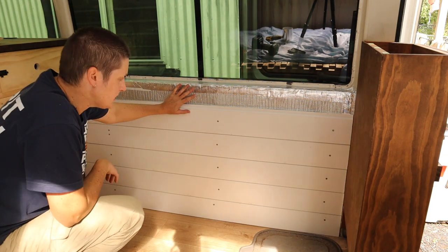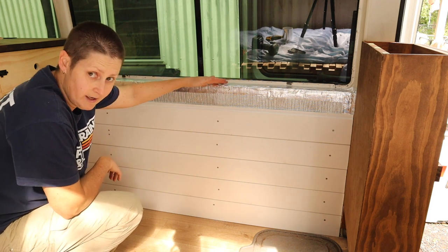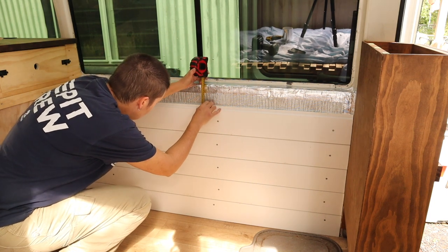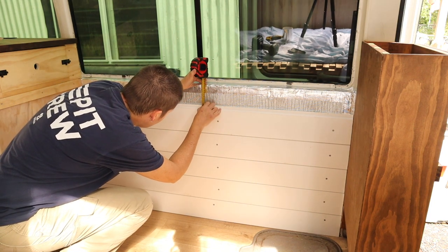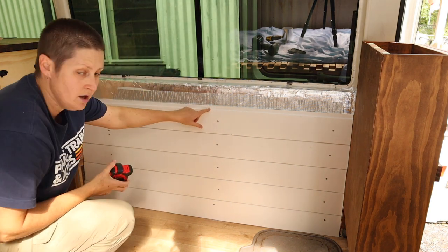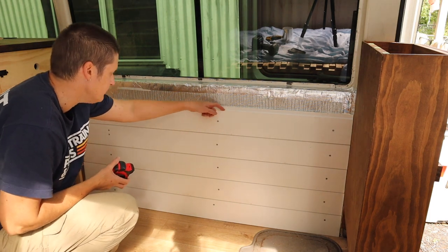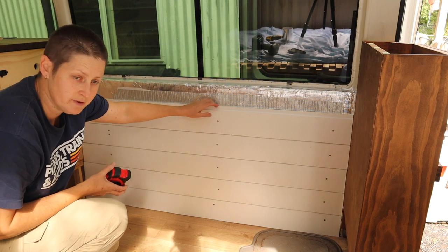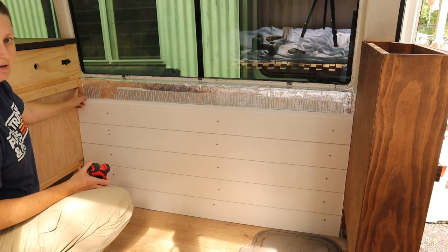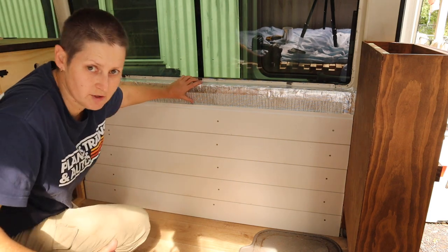This last board is going to be a little bit trickier because I have to trim it to size — it's not as high as a full board. Measuring it, it's about 115mm, which is pretty much where the lip starts, so I'm going to have to cut this little flange off on the table saw. And at this end I'm going to have to cut a little notch out to get around the end of this cabinet. Tricky, but should be doable.